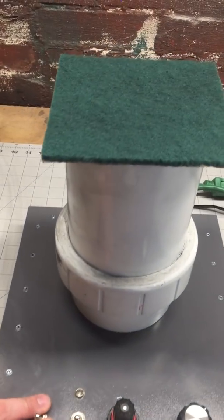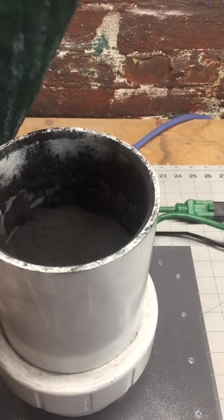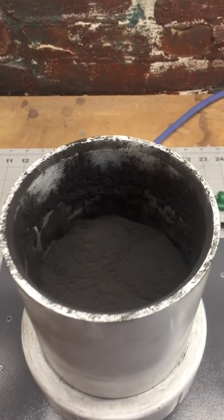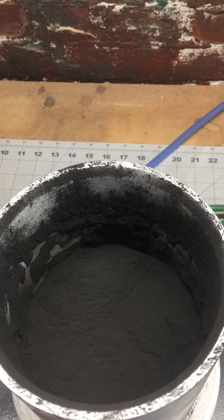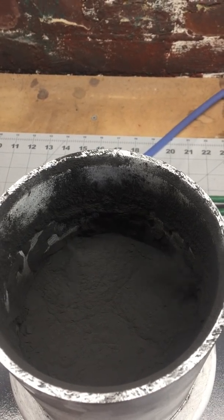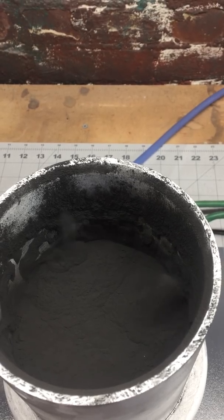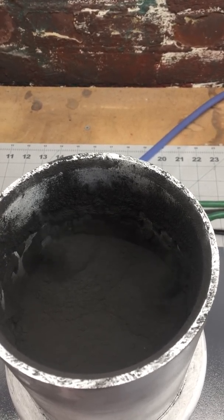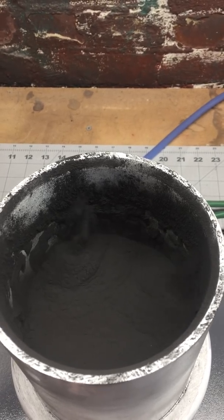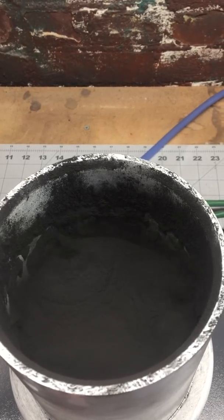So I'm going to go ahead and turn on the air — hopefully that's not too loud — and what I have in here is some matte black powder coating. I'm going to go ahead and start increasing the air supply into the chamber, and we'll start to see some geysers form. That's because this specific powder coating is a little too small to properly fluidize. No matter how much I adjust the airflow, I will never be able to get this powder coating to properly fluidize.